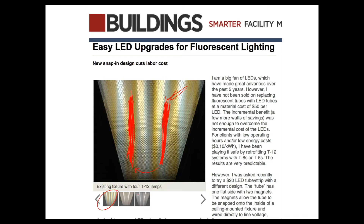Another great feature about this retrofit is you're getting rid of a lot of points of failure. In the original system you have four lamps, a ballast, and lamp holders on the ends — all plastic parts which tend to fail in fixtures that might be 10 years old. These new LED tubes do not have ballast; they connect to line voltage. They're slightly shorter than regular pin-based fluorescent tubes and don't even have any pins, so they just snap in without dealing with lamp holders at all.